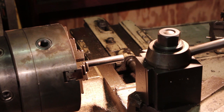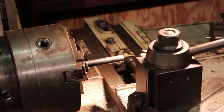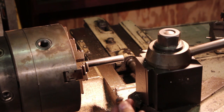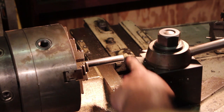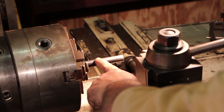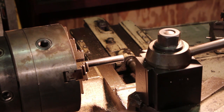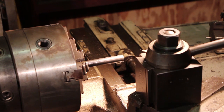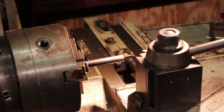With the bushings done and the wheels done, all that's really left is to make the axle that the wheels are going to be turning on. This is kind of a rivet-looking piece - it has a rounded-off head on one side, turned down to three-eighths of an inch, and it's two and a quarter inches long. We'll go ahead and turn these down to size first for the axle, and then I've got a little tool I've ground that has a radius in it that I can use to make those heads. Then we'll part it off after that.